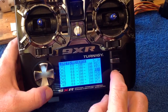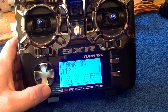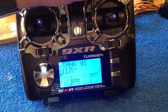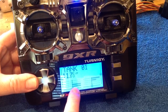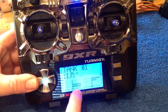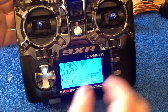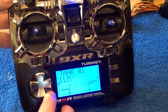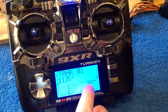Exit. Now hopefully — and I don't have an RC2HL to test this with — we should have the proper operation for turning on your RC2HL. When we flick this switch, we should see both channel 4 and channel 3 move across here. Ta-da! That is the signal you need to turn on the RC2HL. If it's anything different to that, the RC2HL will not turn on. You should also have machine gun — you'll see it move — and when you fire the cannon, you'll see the recoil servo in action.